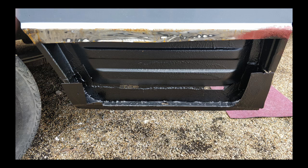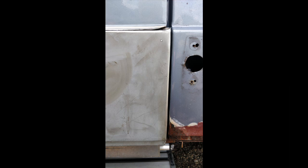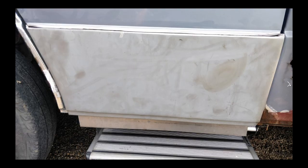On the inside, a good coat of underseal, and you can see a drain hole I've made to let water out. There are also slots for the document holder that goes inside the door. Now, the new outer panel was too big for the door. I cut the old panel off right up to this top lip with the intention of welding in that gap and filling over it. But when I offered the panel up, there was a five-mil difference — it was just too big. That's quite common for pattern parts. You can see how much bigger it was — sticking out at the back, so the door wouldn't have shut if I'd fitted it.